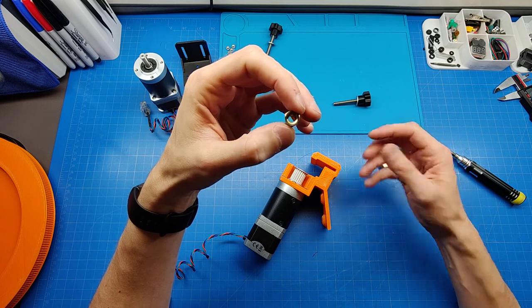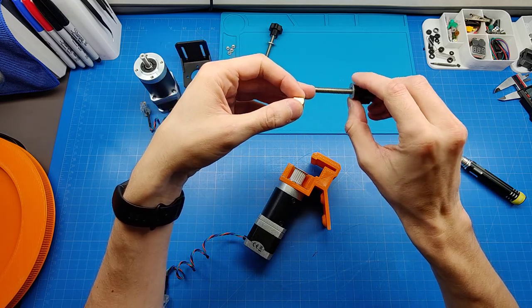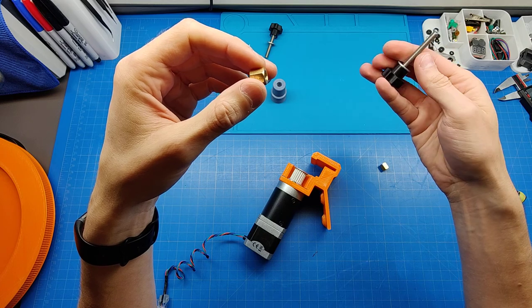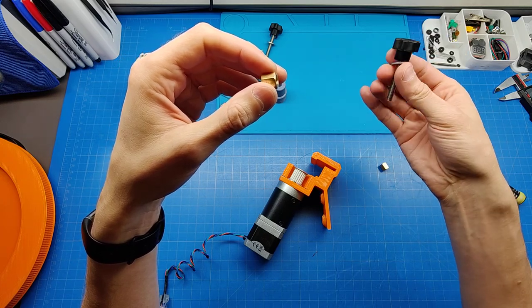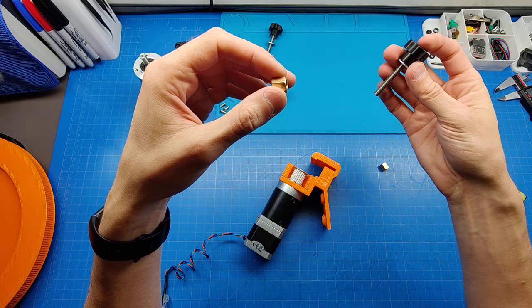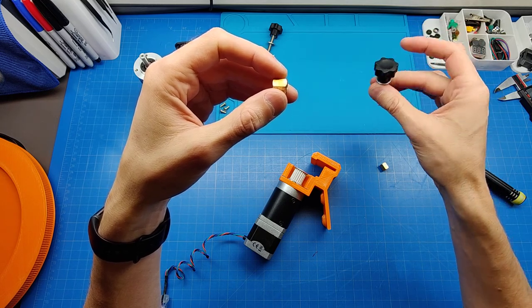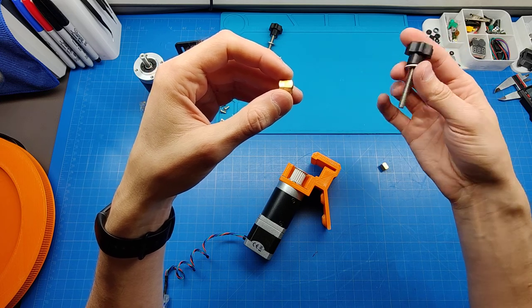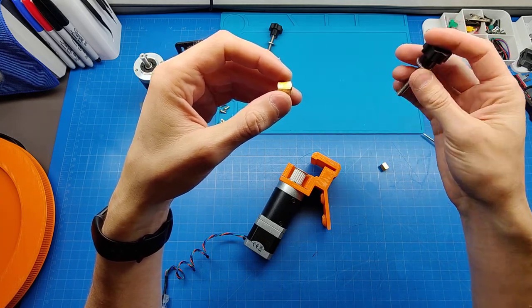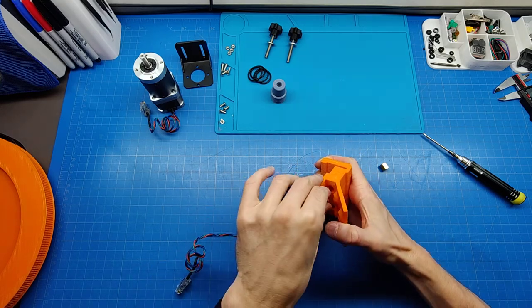But in this specific case, you may use just regular M6 nuts and any kind of 40 millimeter knurled bolt. I had those from some of my other devices where I replaced the bolts in my MSLA printer. I had those for holding a vat in my MSLA, and I decided to replace the plastic knurled nuts with full metal ones, because that nasty liquid in an MSLA printer destroys plastic. Really, it's getting crumbled, so I kept those knurled screws, and they came in handy for this telescope mount project. Anyway, hoarding all the way, right?